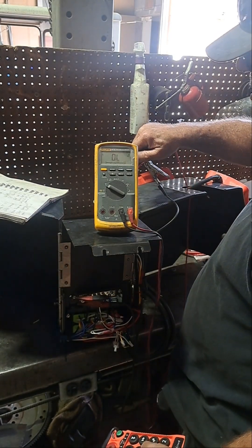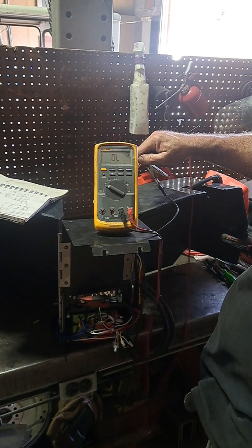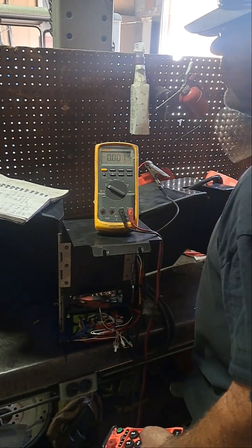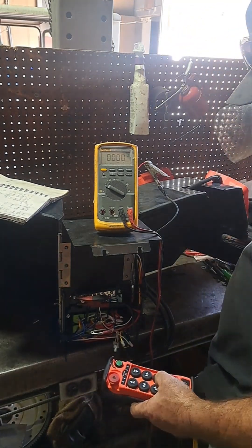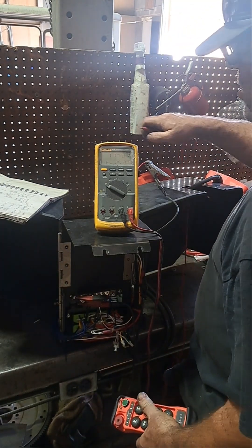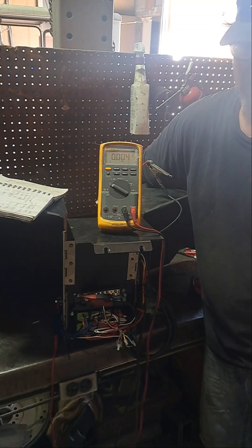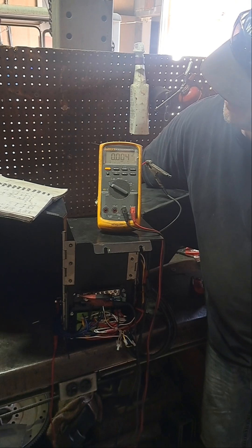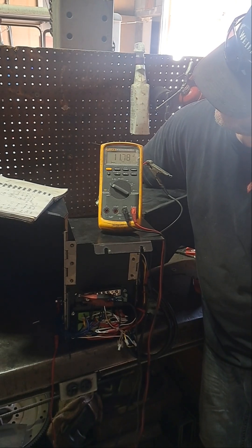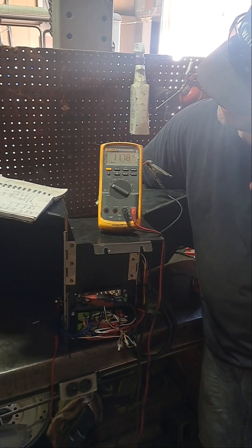Winch — yellow number one. That only activates the relay in the receiver because the winch is electric. Green is going to be winch up. And then in the back I have the override button that turns the pump on. It'll have levers so you can park the boom in case of remote failure or receiver failure. And that is connected into the same bus that turns the pump on.